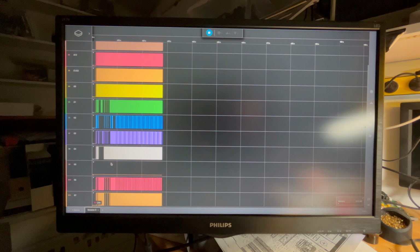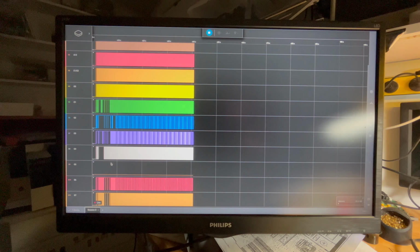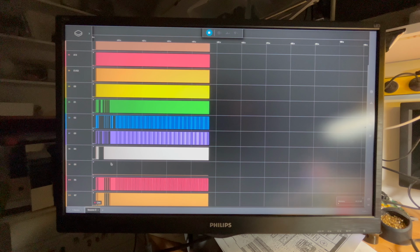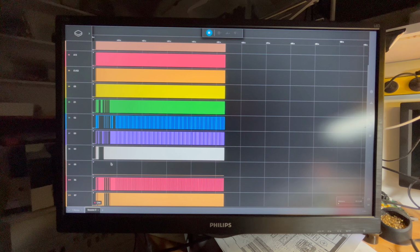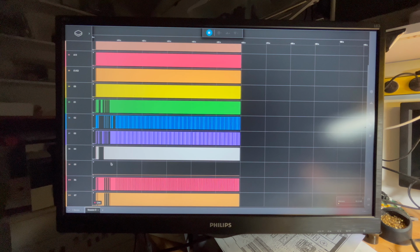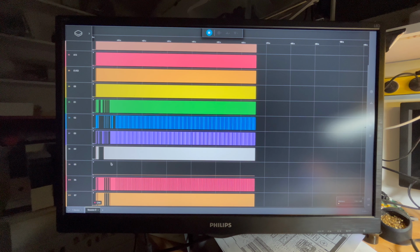So for it to go high, let's write this down. So this is A11, A12 and A13. So for O5 to go, actually it should be high all the time, according to this. Was it active low? Well, basically all the outputs should be high. Okay, this is for an LS138. Accepts three binary weighted inputs, A11, 12, and 13. And when enabled, provides eight mutually exclusive active low outputs. All right, so it's always low. Never goes high. O5 is always active.